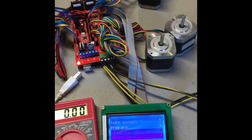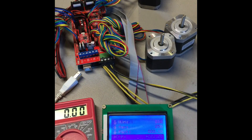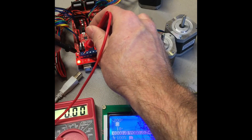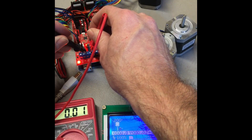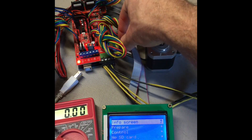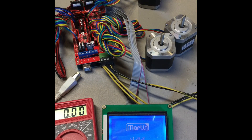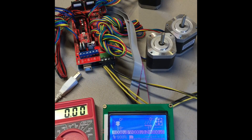So that's perfect. Now I'm going to go and set the fan back to zero — we should be getting zero volts there and you'll see the light go off. Next thing we're going to do is go in and do a preheat. Typically when you're printing you don't need to do this — the G-code is going to do it all — but this is going to heat the hot end and the heat bed at the same time. So when we do this test we should get 12 volts at D10, zero volts at D9, and 12 volts at D8. Those are all good. So now I'm just going to press the reset button on the RAMPS itself — this just sets everything back to zero. If you were to hit the reset and you were still getting voltage at any of those, it could be that one of the MOSFETs is blown.